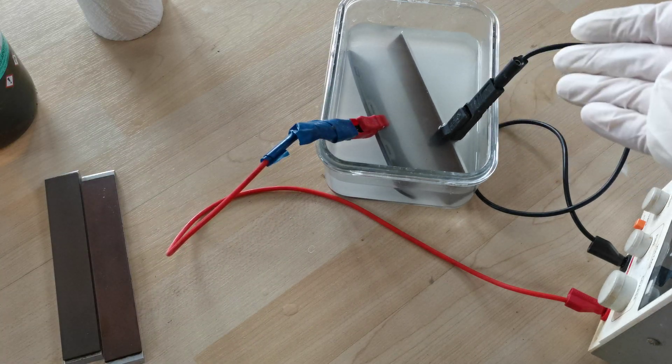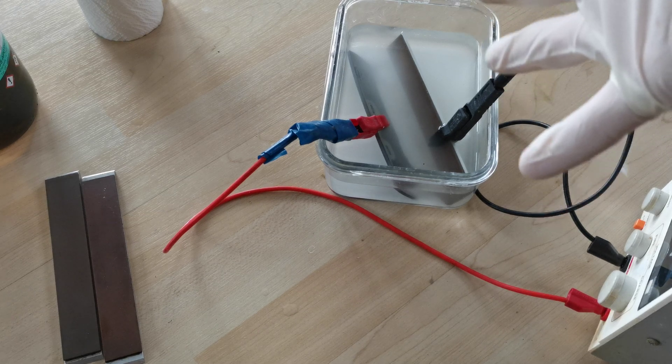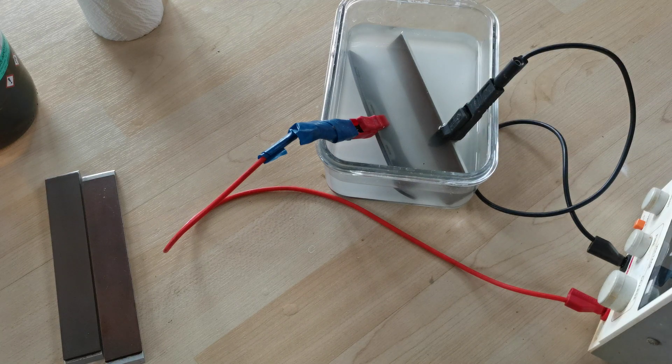Basically this is reverse electrolysis. The idea I had was: these stones are metallic bound, and CBN and diamond are non-conductive, but metal is. So what if I just use reverse electrolysis? What happens — and any chemists watching, forgive my crude language, English is not my mother tongue — basically the copper ions are ripped out of the stone and travel away from it, while the non-conductive CBN or diamond remains in place. The more you rip out of the copper binding, the more these abrasive particles stick out and make the stone aggressive again. The same for any steel swarf built up in there — it will be removed very fast.